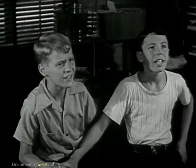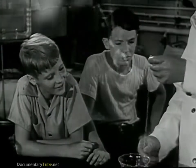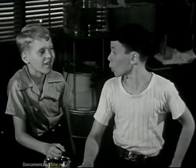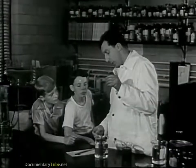Could you tell us just how it's made? Yes, we want to tell the class about it. Well, it's quite a story. We make rayon from wood, you know. Have you ever seen a spider spinning a web? When we make this rayon fiber, we're imitating a spider spinning a web. The spider makes a liquid in its body, and when it spins the thread for its web, it forces this liquid out through tiny holes called spinnerets. This makes a fine thread. You know how silk is made? We've had that. Well, then you know how the silkworm makes a fiber. We make this rayon fiber in somewhat the same way.